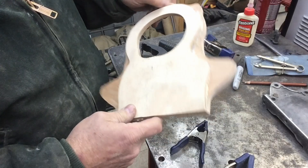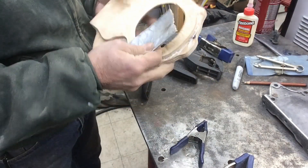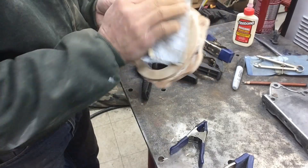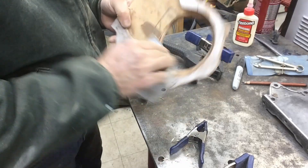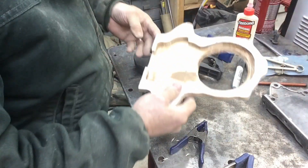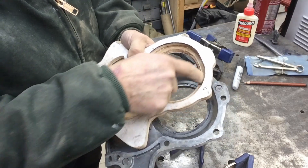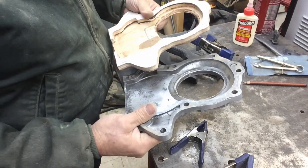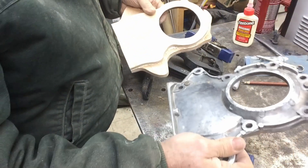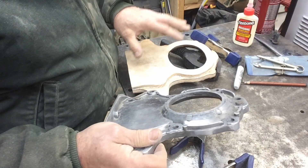Okay, there's our pattern glued together. It will take some cleanup, but I'm gonna go ahead and start sanding this contour. All right, there's the back portion from where we are right now. This area will have to be filleted in, and we'll have to finalize the shape a little bit. But all in all that doesn't look too bad. On the outside we've got it there, but we can always change these contours. Now what we'll do is add one more piece on top — probably three-quarter inch stock — we'll add draft to that, very similar to this, and put it on there.